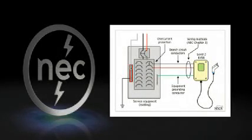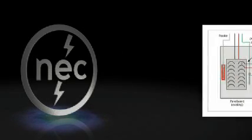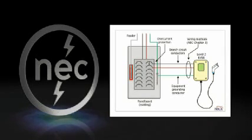In Chapter 2, you have your overcurrent protection requirements for branch circuits. You have your grounding and bonding requirements for installations. In Chapter 3, you have your conductor sizes in Article 310, and you have your wiring methods covered in Chapter 3. And all of those are inherent components for installing a branch circuit to service equipment or a panel board that's going to supply electric vehicle supply equipment. And then what you have in Article 625 is the specific requirements for that type of equipment.